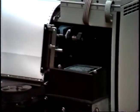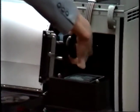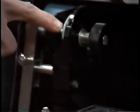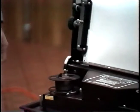In order to do so, pull out on the dial and turn the dial until the white indicator lines up with the pointer. Being careful not to move paper. After that, move the dial so paper travels downward until the indicator has traveled 1 complete revolution. After that, you adjust the platen lever for the desired forms thickness, and that completes setting top of forms.